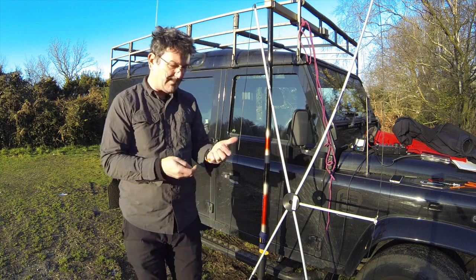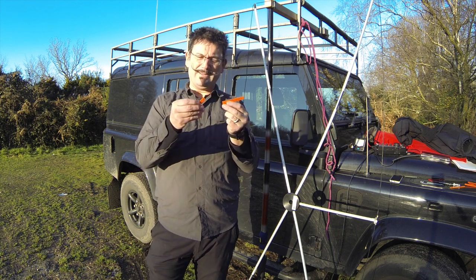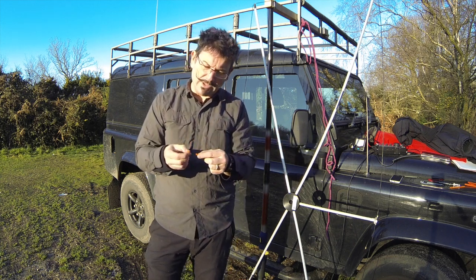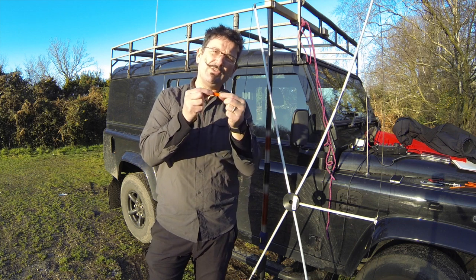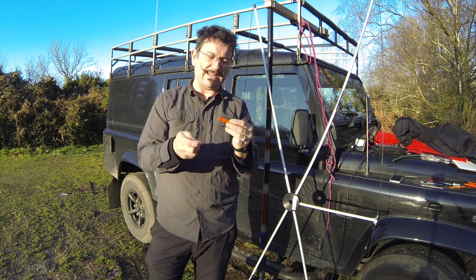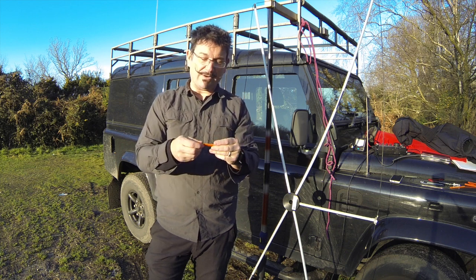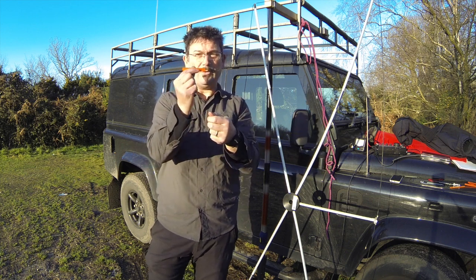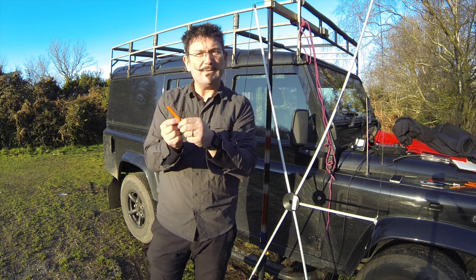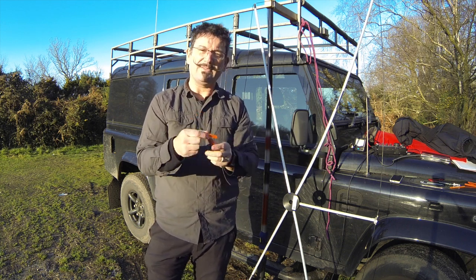You'll remember I mentioned I seemed to have an extra pack of separators - that is because they break very, very easily if you put any force on them. They've got a little score line showing where to bring the end of the cable to, and the gap between the ends of the cable is quite critical. If you put any pressure on these they snap instantly. I recommend feeding the cable through the two holes in the end and holding them by the very end while getting them in position - if you hold it in the middle and pull the cable around you'll snap it off very quickly.